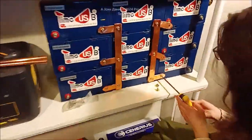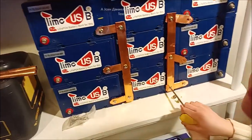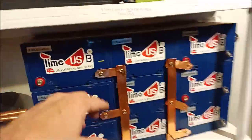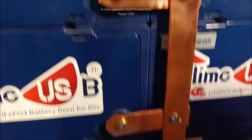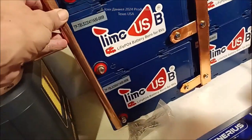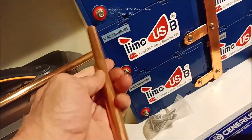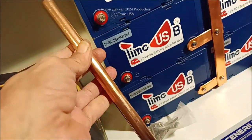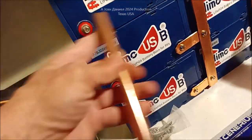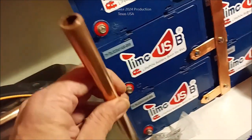Back in here - Kira has installed the first set of bars and is working on the second set. Here's a close-up of what it looks like. It's really simple. We're going to have this copper bar - I'll be flattening these copper bars out - it'll connect these three, drilled out and flattened. This is Type L copper, not thin stuff - very thick and totally capable of over 250 amps, which we'll never see from this at 36 volts.